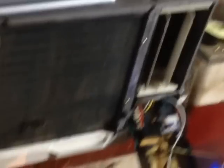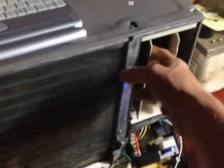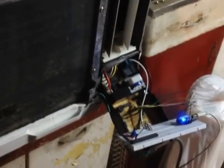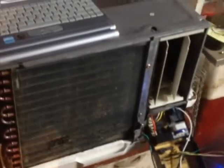I'm going to use the pipe sensor to actually tell me when the AC pump needs to be shut off. Because this thing is going to be remote mounted in an attic where you can't have access to it, with vents coming off to cool a room - basically because it's for a music studio. The whole point of this is to remote mount the air conditioner where the sound of the air conditioner can't be heard. Being as it's digitally powered and remotely controlled, it'll be able to turn the fan speeds down to virtually nil when there's recording going on, and turn it back up to full power when the recording stops, to keep the customers happy so they're not sweating on top of ruining the recording time because it's making too much noise. This is Nathan with Sobe Source, signing off.